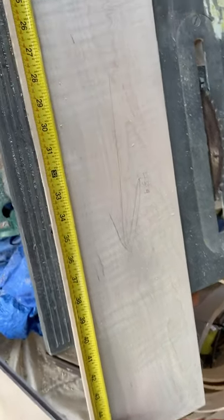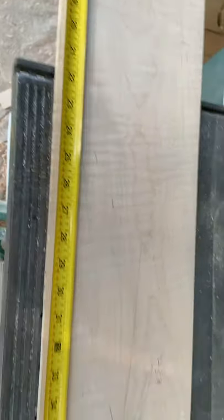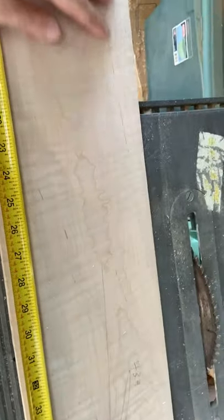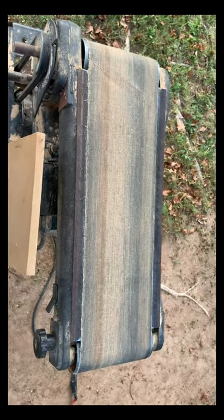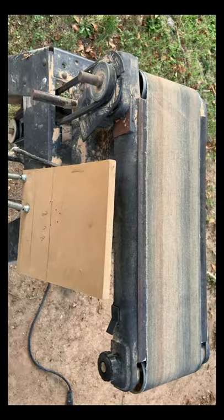This is the time where you'll be picking out which side you'd like to be the outside — which way you think the wood would bend most properly. Take your time, check the wood out. If you see anything that looks like it could be solved by bending it the opposite direction, go that way. I just like the way this side looks, and this curly maple is beautiful for bending, so we're going to go with this as the outside for the rest of these. Now it is scarf joint time. I'm sanding them on the belt sander with this crude little scarf joint jig, but man does it work.